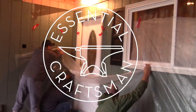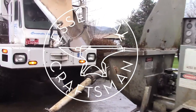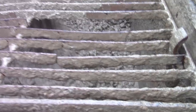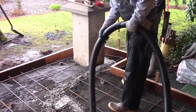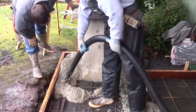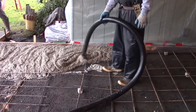You're watching us place a brand new sand finished patio right over the top of an existing patio that is probably 35 years old, and it's broken up. It was ready to be replaced. Now, ordinarily, this is not good practice. In fact, you should almost never do it, because existing concrete will telegraph right up through the bottom of a new pour whatever its cracking problems are, and in just a short period of time, those old cracks are going to appear on the top of the new work, and somebody is going to be in a lot of trouble.